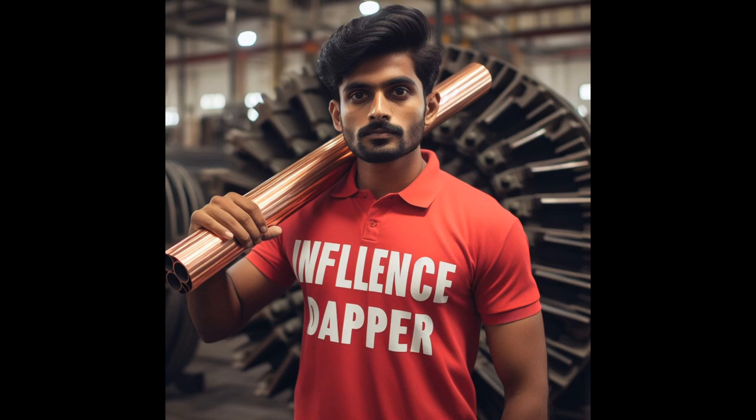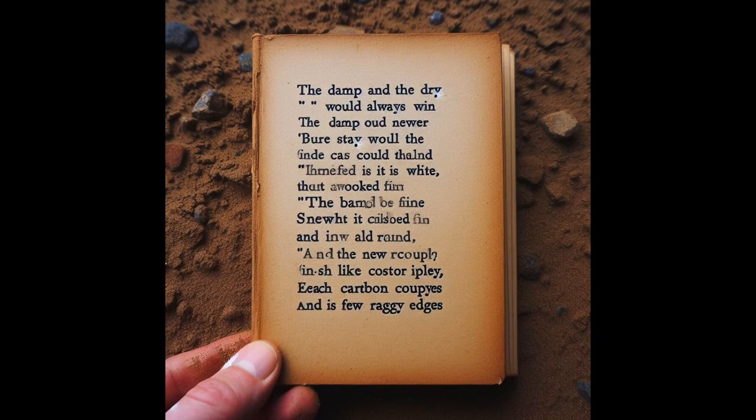While it is theoretically possible to melt aluminum precipitation obtained from an aqueous solution to obtain metallic aluminum, there are practical considerations to keep in mind. When aluminum precipitates out of an aqueous solution, it typically forms as a compound or in a mixed form with other substances, rather than as pure metallic aluminum. To convert this precipitation into metallic aluminum, a reduction process would be necessary to separate the aluminum from any accompanying compounds or impurities. One common method to achieve this is through a process called thermal reduction.